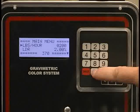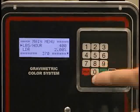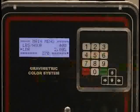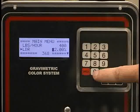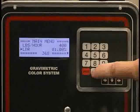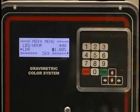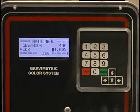If I wanted to change that 200 pounds per hour, I could change it here with a leading zero and make it 400 pounds per hour. Then I page down to the letdown rate. If I wanted to change my letdown rate, I press enter. To change this to 1% using a leading zero, I enter 0-1-0-0, then enter. I am now set up to run 1%. Turn the switch on and the unit begins to operate. It's as simple as that.